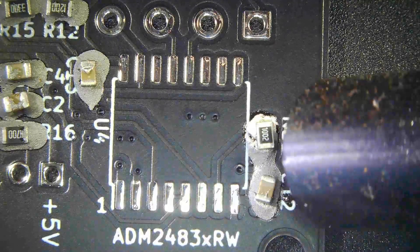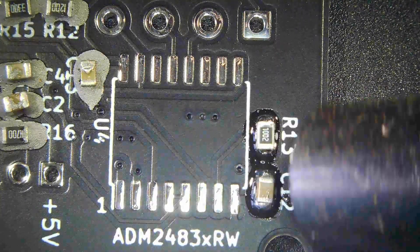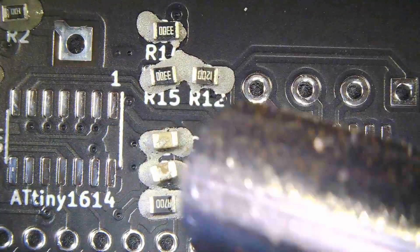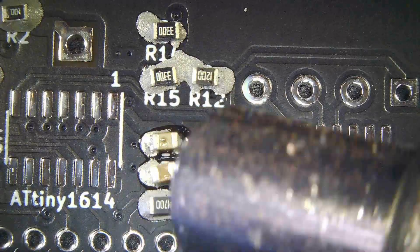So I'm now attempting to flow the solder paste. As you can see, it made a right mess on the board. Being lead-free it doesn't want to melt either, but I managed to coax it in the end. I'll need to invest in a reflow oven if I plan on doing a lot more of this.